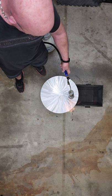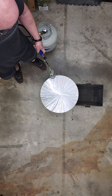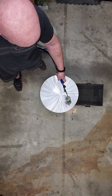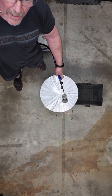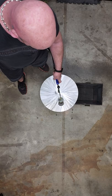The first colors that start showing up are your amber, kind of your brown-amber colors. After that it goes into your violet, then into your sapphire blue, then silver blue. As you heat it up, once you go too far you can't go back, and if it goes too far it'll come back to kind of a gunmetal blue — not a real pretty color. This all depends on the kind of look you're going for. Some of my pieces I don't want blue, so I do a lot of ambers. I've got about 50,000 lumens of light up here, and I look for the shadow cast of kind of an amber tint and then I start coloring accordingly.